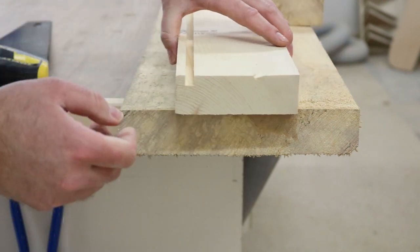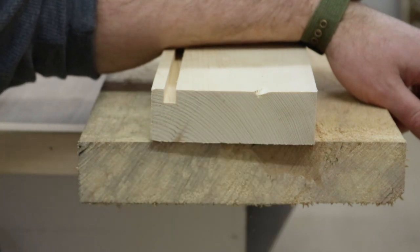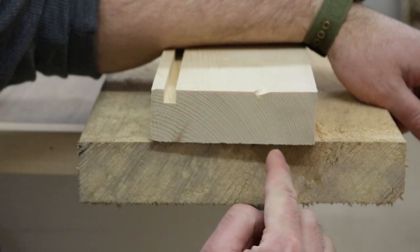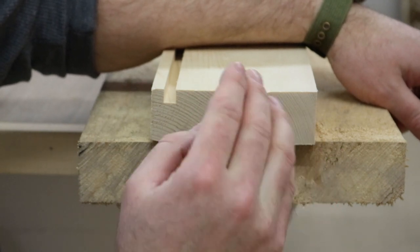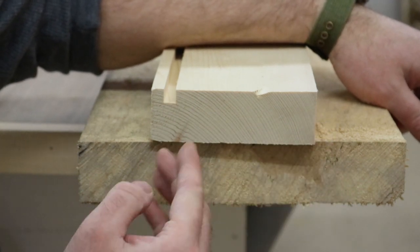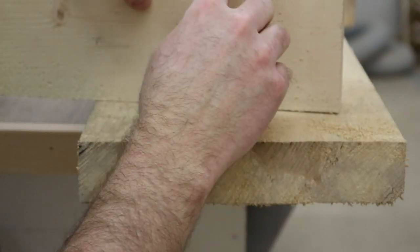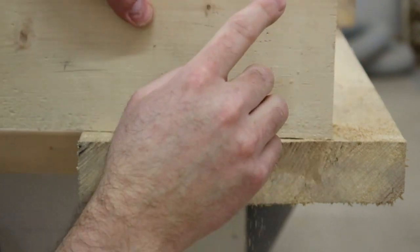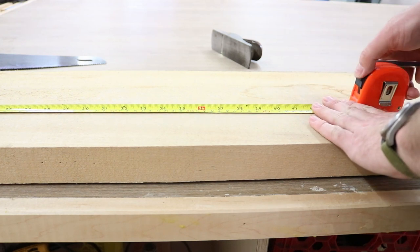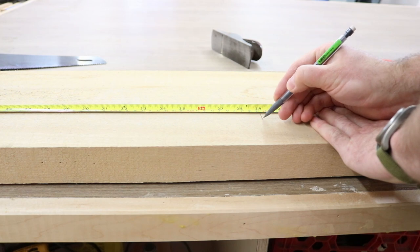You can probably see it a little better on this piece of pine. You see these lines going through here, those are the growth rings of the tree. When you have the lines going at an angle like this and you cut out a square blank, you have straight grain on all four sides. Versus if you have more vertical grain, you have straight lines on one side, and then a more open pattern, or cathedrals, on this face, which doesn't look as consistent or as nice for legs. So the goal is to get this diagonal, or rift sawn, grain throughout the whole set of legs.